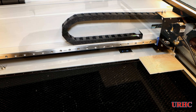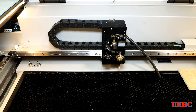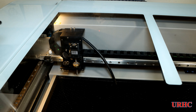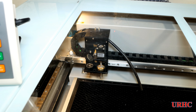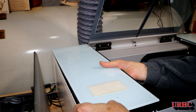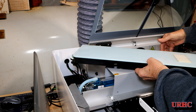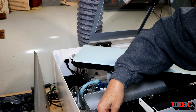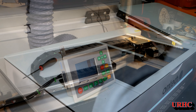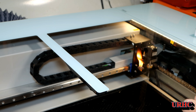I take another shot and I'm getting closer — not quite perfect yet. You have to do it at both ends of the travel too, because if you're slightly out of parallel to the rail you have a problem. I fired one at each end and was using just one target so you could see where the two shots landed, but you have to clean the mirror between shots because of that black soot. I cut off the tabs below those metal retainers that hold the cover in place to make it easy to pick right off.